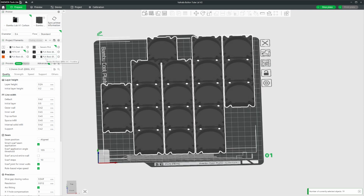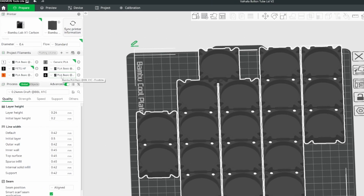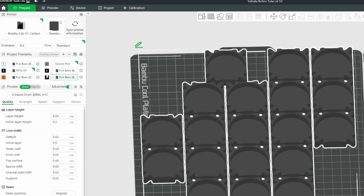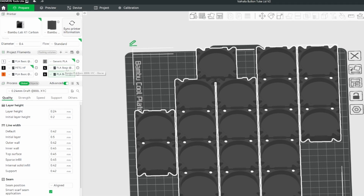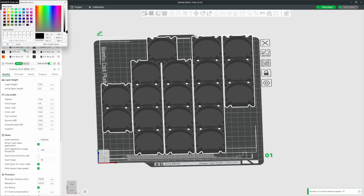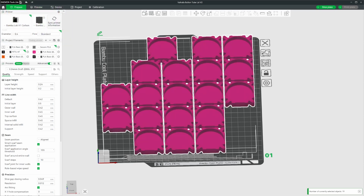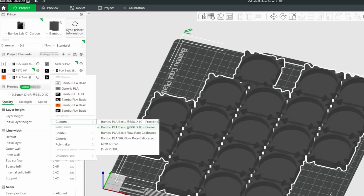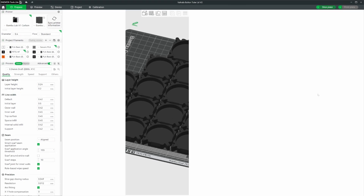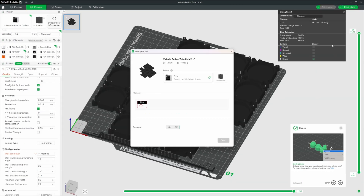I also want to make sure that if the machine runs out of filament, it'll continue into the next spool — and those spools need to match — so I'm setting number six to Glacier as well. The color doesn't transfer along with these filaments, so if you want to match what's actually in your system you can change the color, but changing the color won't affect the temperature properties we set. Making sure you create a custom preset, select it, and have Cool Plate SuperTac selected, then we can slice and send.